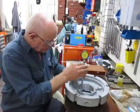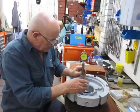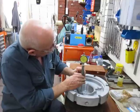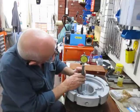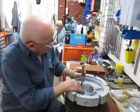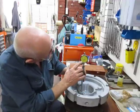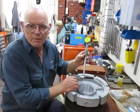The beauty of this is it's quite easy for checking bore parallelism further down. If you go down to the bottom here and check it again, we're spot on — we're within the limits of this particular gauge, which reads to one hundredth of a millimetre.